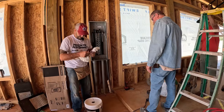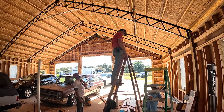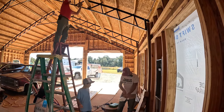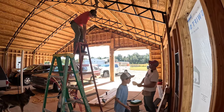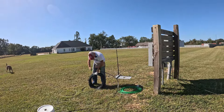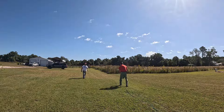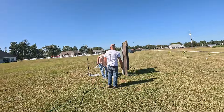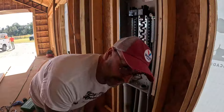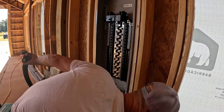We're going to make a mouse to suck through the pipe. We'll put a pulley up here and watch it so we don't put too much strain on that three-inch pipe. No eyes or anything - just a bag like a parachute. Some people call them a rat. We've got two hots and a neutral. I'll identify the neutral - the other two don't matter, it's single phase. Tommy's out there with the bag and we're just going to suck that through with the vacuum machine.